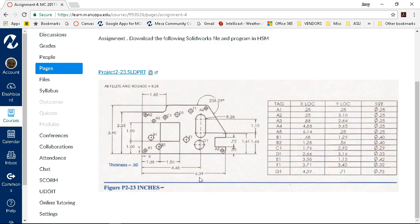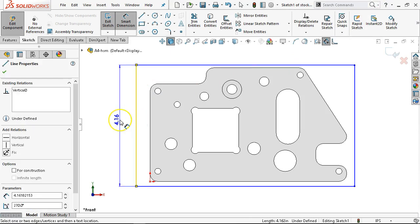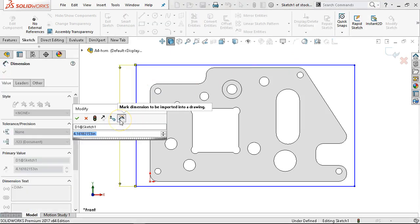If we're doing half-inch by four-inch bar stock, we're going to have to be pretty close on the sizing. That's going to be my first choice. We're going to clamp this down to the tooling plate some way. After I've opened up these pockets, I have a pretty good chance that at least two, three, or four holes are going to appear underneath that I can clamp through.